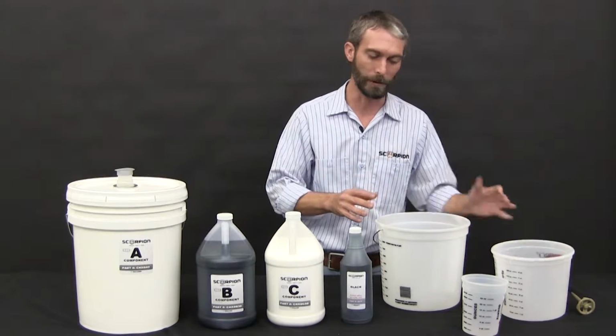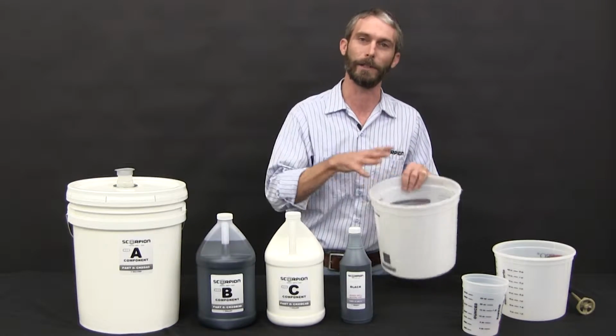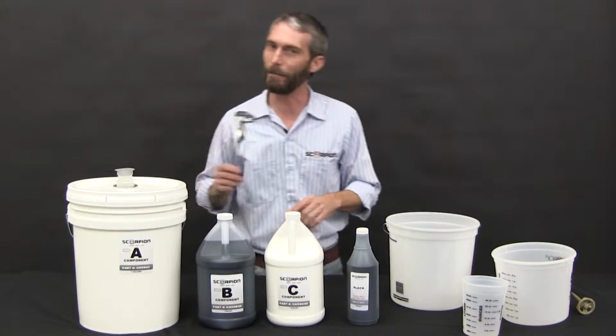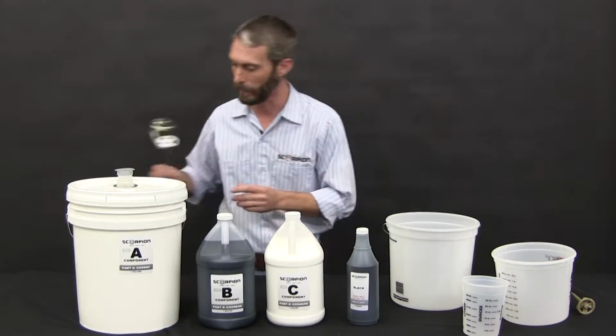Now if you go to a point that you're using the gripper granules, the rubber crumb, or the vinyl flattener additives, you've got to go to a 10 quart to have enough headspace to hold all the material in one container. Always keep in mind, it is a very viscous material, so you have to use either the 3-inch or the 1.5-inch high viscosity mix paddles.